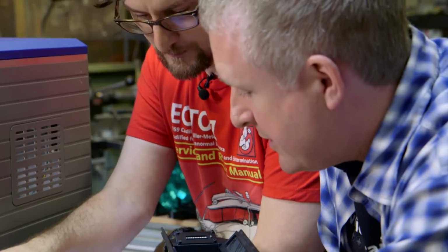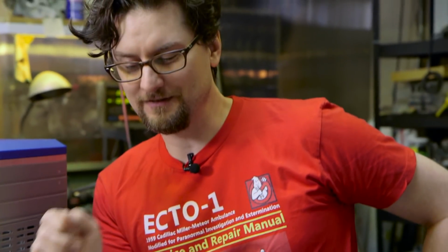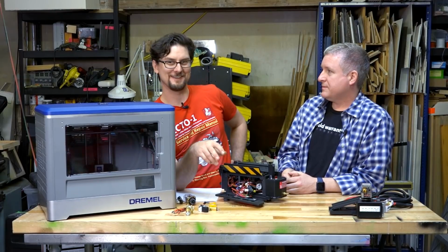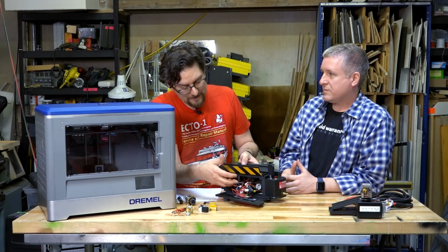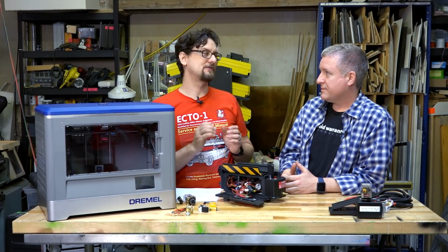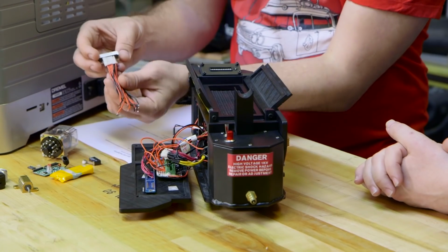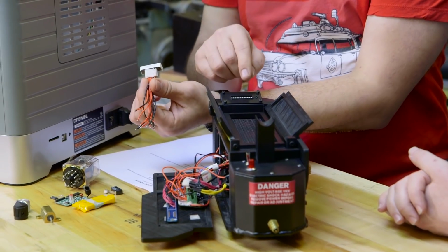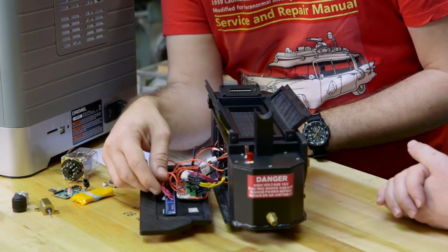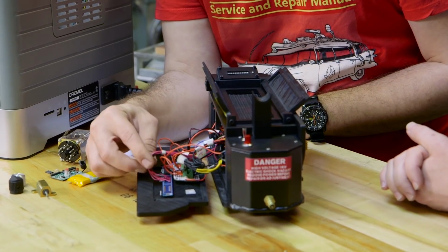You should mention this wire. I guess this isn't the silicone wire. Yeah. But this is, and it's wonderful. Oh my God. I mentioned in my favorite things video, this silicone wire that Adafruit's been carrying is amazing. When you have to pack this much stuff in there, it made things so much easier. It's very flexible. But in this case, this is the first version of the bar graph they did. Even this was a little too bulky because it has to fit in with the mechanics of the door. Yeah. So this is just some miniature flex wire that I used for that worked really well. Yeah, it's good because it's small.